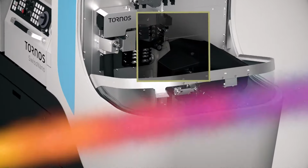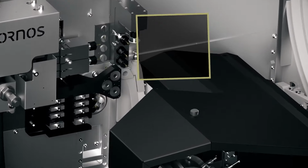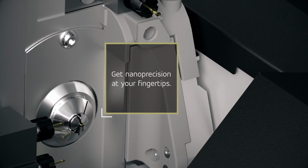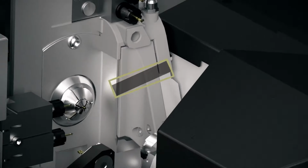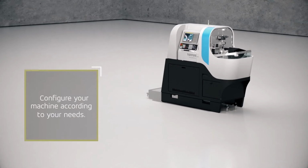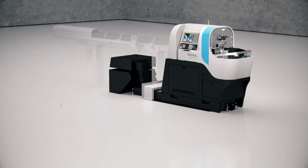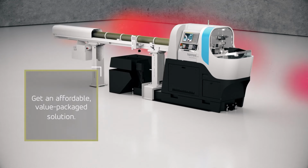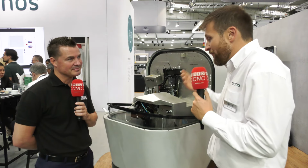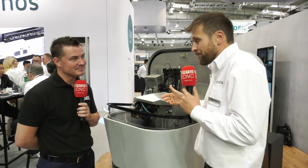It's not only that, the ergonomy is also excellent. You have this counter spindle that sits on three axes, like on the 360. You are facing the guide bush, so you're working on really tiny bar. You have to center your tool in Y. You're in front of the guide bush, it's just ideal. And the fact that the counter spindle again is on three axis, you can center your tool just with the CNC. So people really like this machine. It's compact. It's powerful in its way, it's a reliable producing partner.